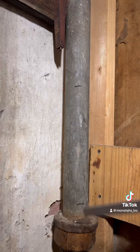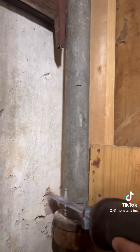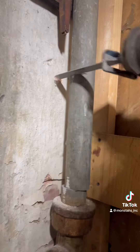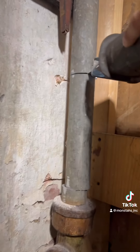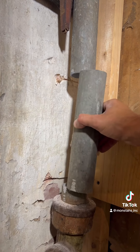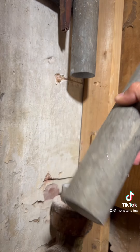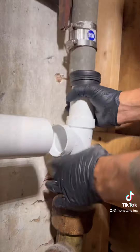We're going to mark, cut, and then use the Sawzall. This is a Lennox — I got it from the supply house. We're going to cut the two-inch galvy vent. In our state you can stack two tys on each other as long as the center-to-center is no more than 10 inches, and that's what we're going to do here. We're going to use two MJ clamps to get this thing tied in.